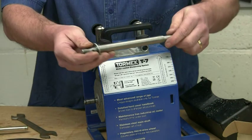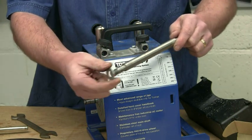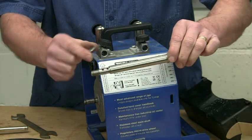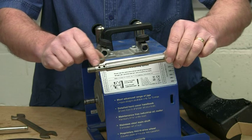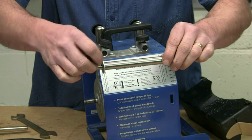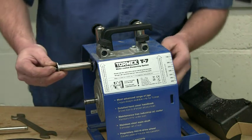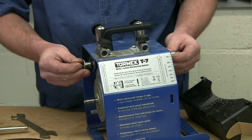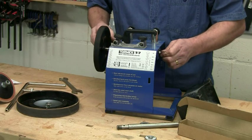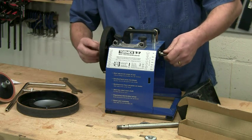Notice the drive pin fitting through a hole in the shaft. Take this out carefully and remove the washer, which then fits back on the new shaft. You can see there are two holes for the drive pin on this one, and which one you use depends on the age of the drive wheel — I need to use the end one. Feed the spindle back in, making sure it seats properly in the bearing, and then refit the drive wheel and lock it with a nut.